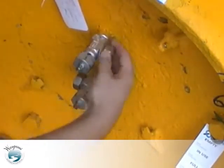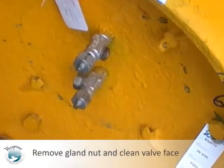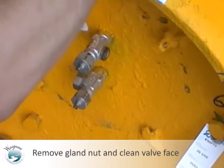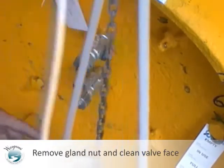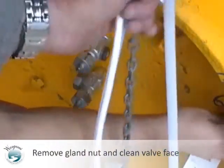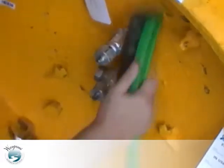What will happen if it's leaking of the ammonia? You'll find a white cloud that will come up. So what we need to do is just give that first — that service — the face of that valve a clean with the wire brush, so to make sure that the lead washer is done to seal.